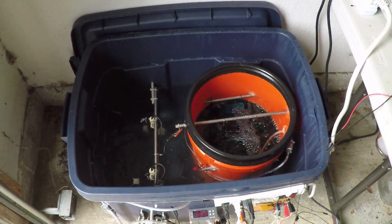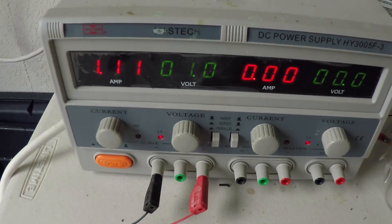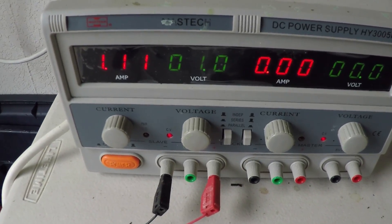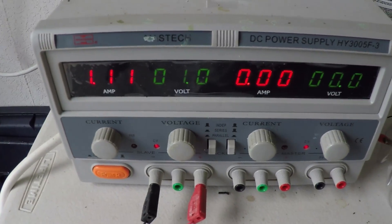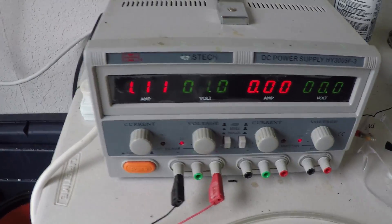Some of the major parts here: I've got the two baths and then I also have this adjustable power supply. Right now I'm plating at one volt, which is actually giving me a little over one amp worth of plating current. So I'm getting a lot of plating for very little voltage.